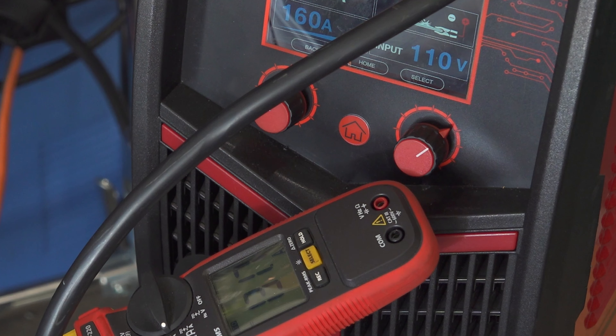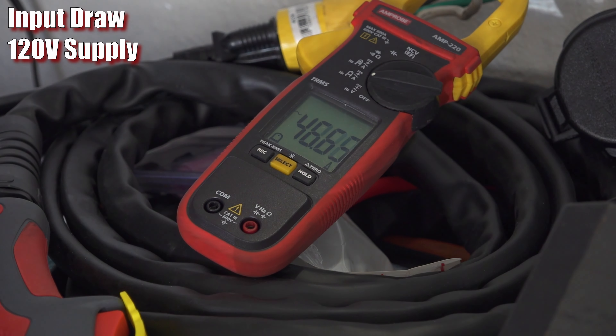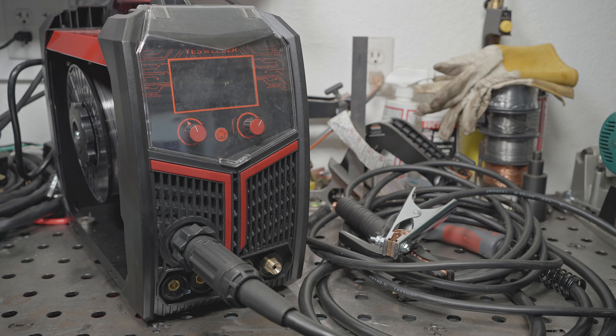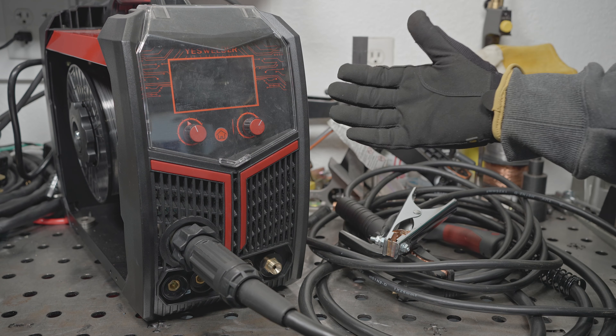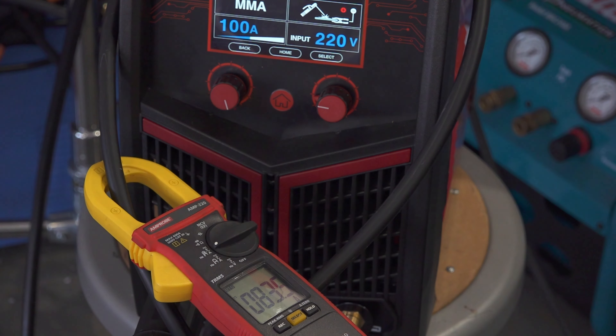To be fair, 130 amps of output on a 120-volt supply is still pretty high, and most people would even be fine with 160 amps of stick output on 240 volts — you can get a lot done with 160 amps. But why does YesWelder seem completely unwilling to properly advertise and properly rate their machines? Not to mention it pulls nearly 50 amps from the wall when maxed out on 120 volts, so even on a 20-amp circuit you will trip a breaker if you try to weld for more than a few seconds at a time when maxed out. The display simply isn't accurate when stick welding across the whole range — when set at 140 amps you get more like 115, when set at 100 you get more like 80, and so on.